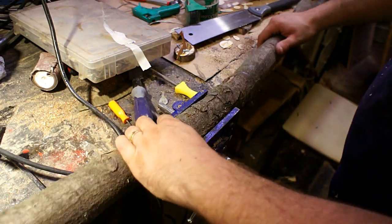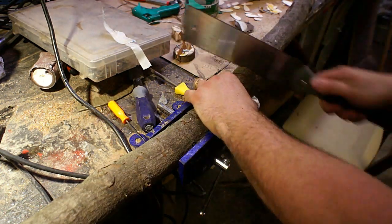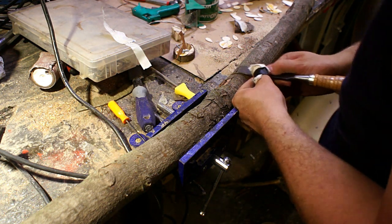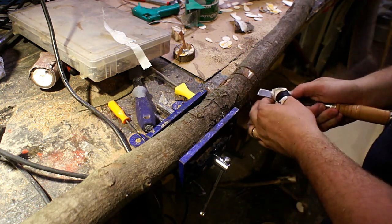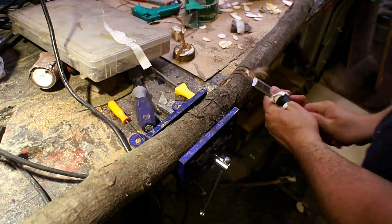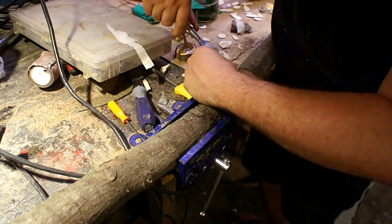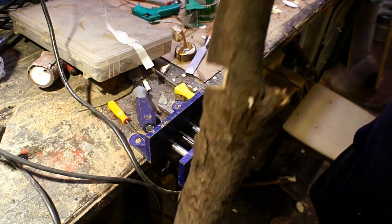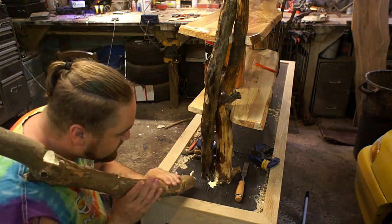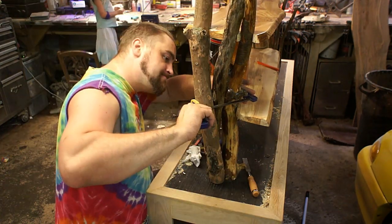For the third upright, the way this branch curved meant I couldn't get into the bottom shelf with the Forstner bit, so I decided to cut into the upright instead. That piece of tape I used was representative of how thick the board was that needed to fit inside. I just went back in with the saw, cut a couple of channels, and chiseled it out. Off-camera I went back and scraped all the bark off and did some sanding to get it ready to paint — then it was rinse and repeat: more dowel holes, more glue, fitting it in and clamping it to dry.